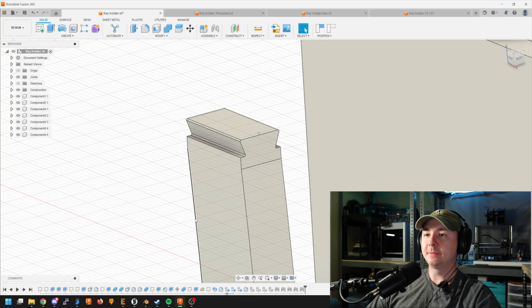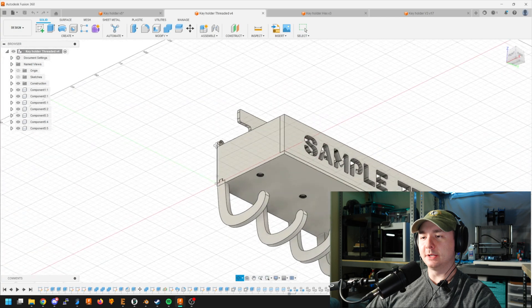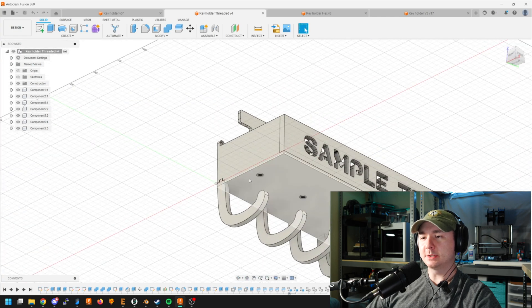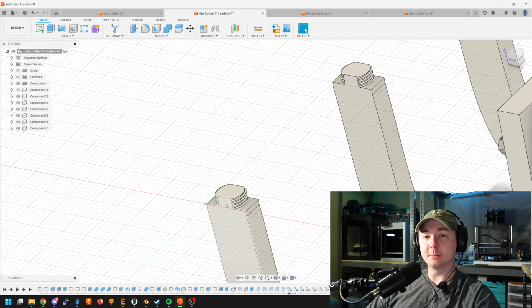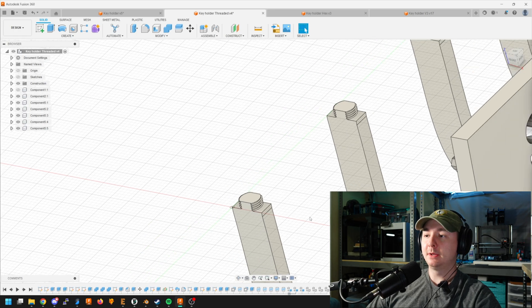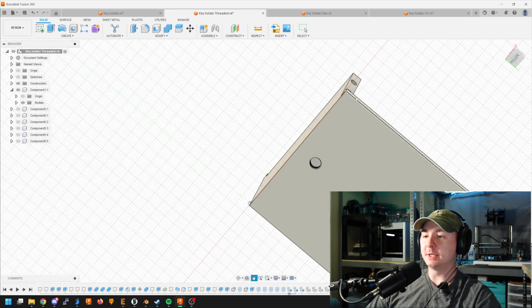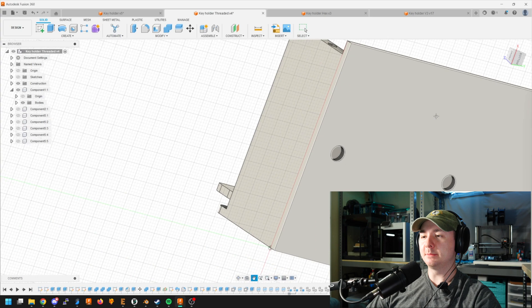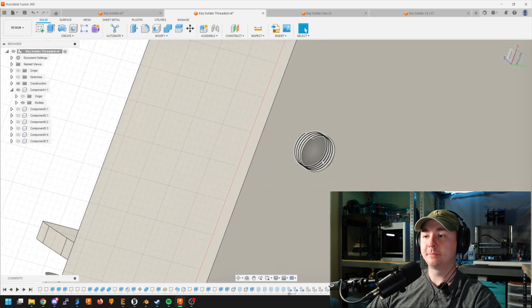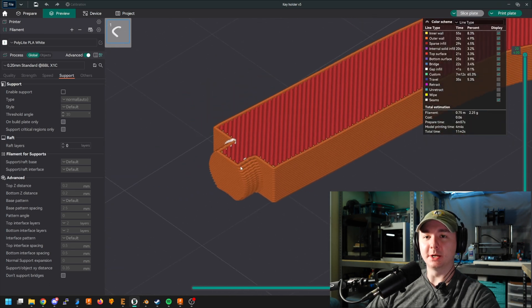So I had to go back to the drawing board. The next thing I did was I thought, well, why don't I just print threads? And that sounds like a good idea - I was going to put threads on the hooks and threads on the bottom. So I would still be able to print these hooks in the best orientation possible because you can make the sides of the threads flat. The problem is that these threads were very, very tiny. And if you wanted to print the threads in the bottom, they would print vertically, and a lot of the times you need supports for that as well. And if you try to print these, the threads are so small that you just get no detail.